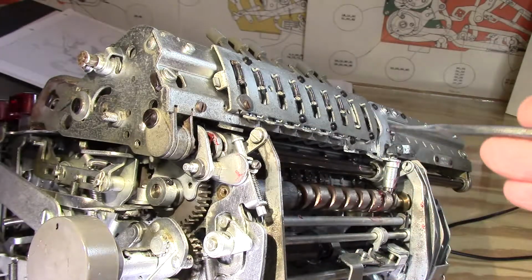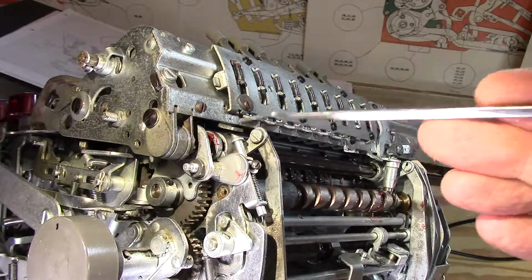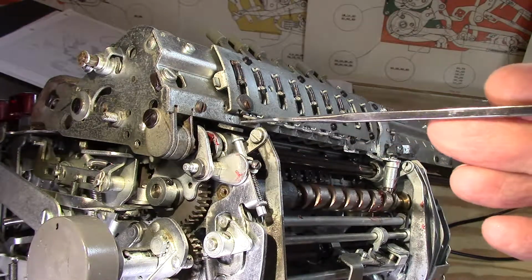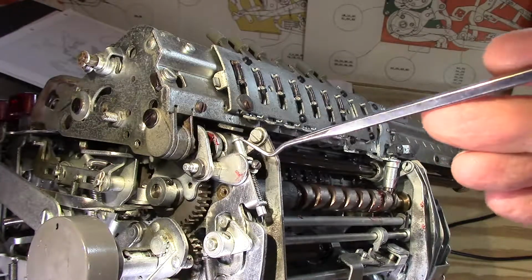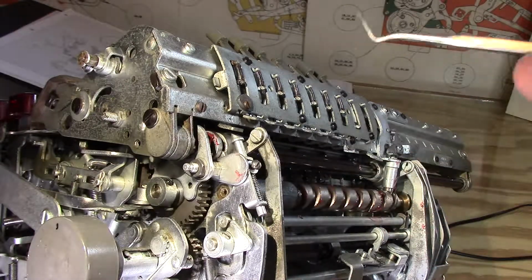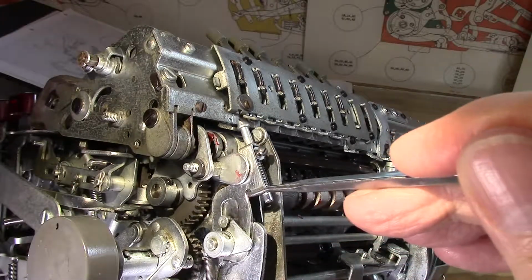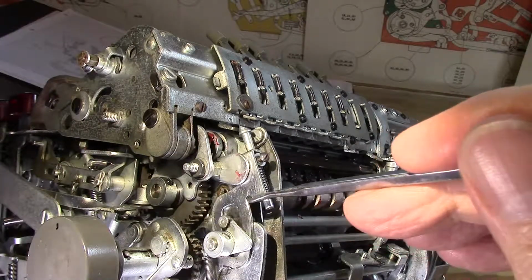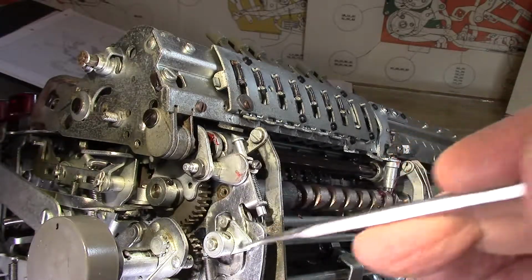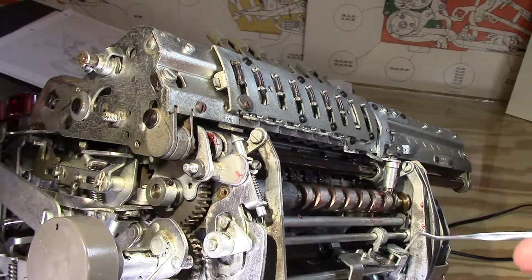Well, it looks like when you are at your stop most position here, or any of these tabs, after going from left to right, it of course is underneath the tab, and then when you go to move it again, that's when it pops up. And I think what's actually happening is it's recoiling too much, and then it goes past one of these other gear features here, and I think that's what's actually triggering it. I don't know if a spring is too weak, or there's maybe too much oil or grease, and it just pops up too far and gets past one of these little latch features, and that causes it to stop prematurely, I think. At least that's my hope, so I'm going to try and explore that a bit.